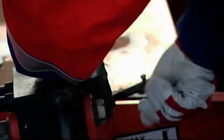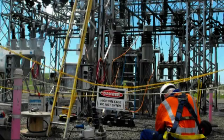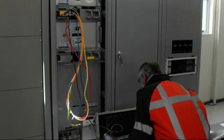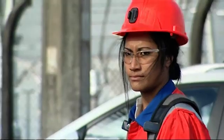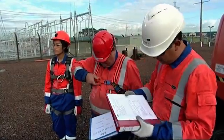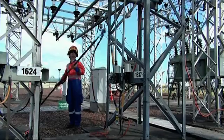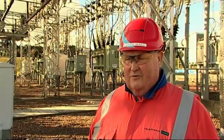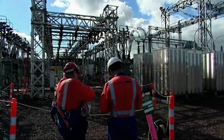We work in a hazardous environment, not a dangerous environment, because we manage our hazards. Substation trainees carry out inspections and servicing of transformers and a wide variety of high voltage circuit breakers. They might joint high voltage overhead conductors, carry out insulation and voltage breakdown tests, or help install substation earthing and safety bonding systems. At least two people will work on any job. Today's operator is Tracey Farrell, who is responsible for all preparation and safety procedures. To carry out any part of a switchyard maintenance procedure, the operator will go through and isolate an earth, which means putting earth safety precautions in place for us to be able to go near the equipment. Then the operator will issue the person with a permit, and it's safe to work on.